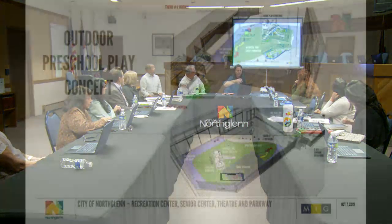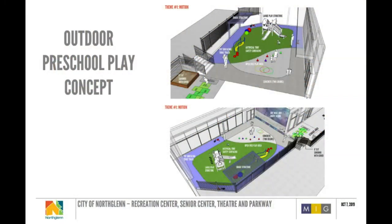And so having that alarmed, but still meeting the crash bar requirement of the fire district, so that if there were a need to use that door that's adjacent, and I'm pointing at it in my head on the screen here, that doesn't do you any good. So this door here counts as a means of egress. We have to have that as a means of egress out of the building, which is why there's that direct connection out.